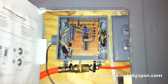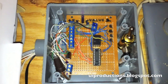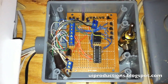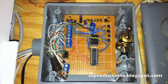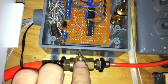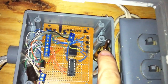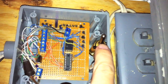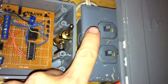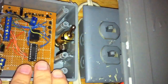In here is the control panel. This is a circuit board that I built that has a PIC microcontroller that actually controls the timing of the door closing and opening, and also the control of the key which can hold it open or closed. Here is the air supply coming in, and there's a valve right here that I can turn on and off to enable or disable the air supply. There's the air release valve here so I can vent the system. And then there are two switches — one controls the compressor located in the attic and the other controls the power to this circuitry here.